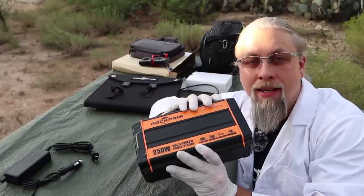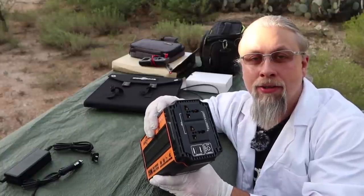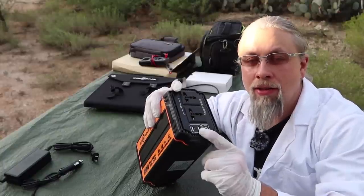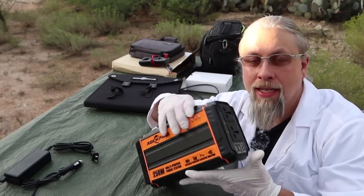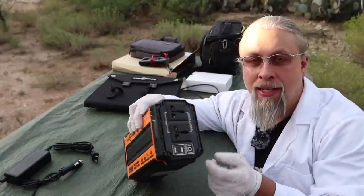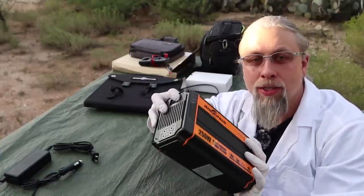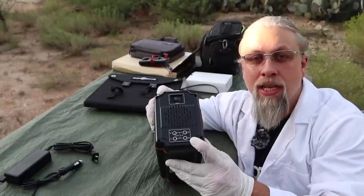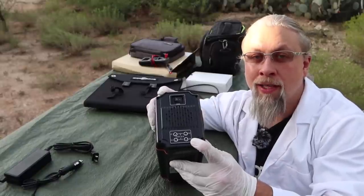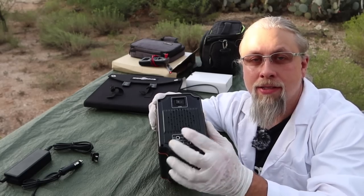The way this is designed, it seems really built for AC power use above all else — it doesn't include USB-C, quick charging, or a built-in 12-volt socket, and it doesn't have a flashlight. It's all about the AC power, and that's why everything runs off one switch. You do have four 5.5-millimeter DC outputs, so you can power lots of devices that use that common plug.